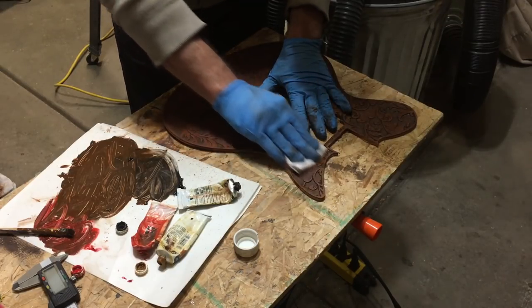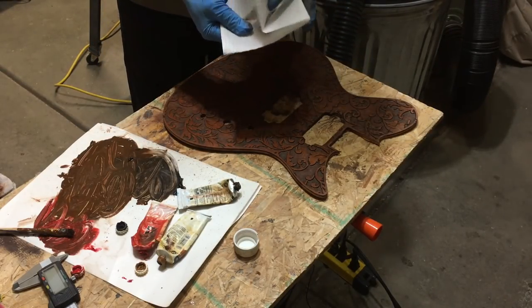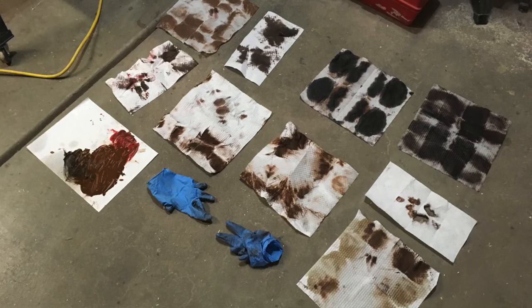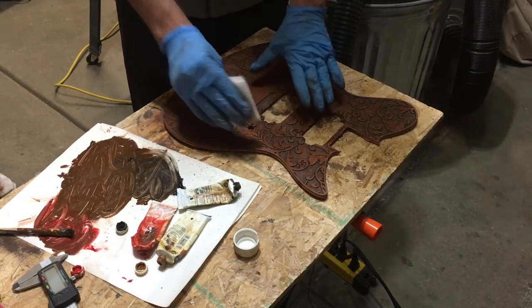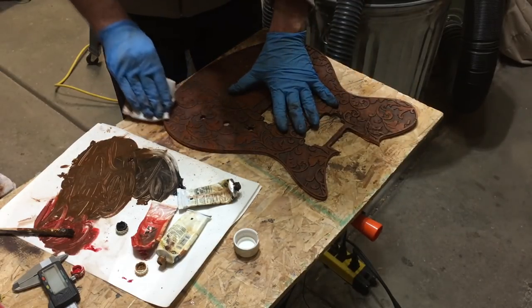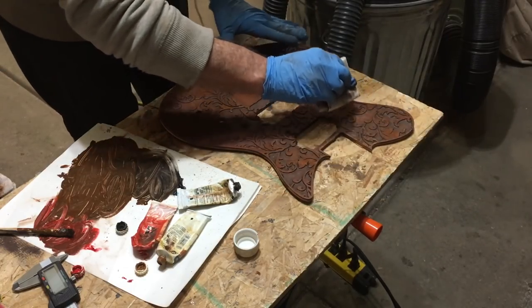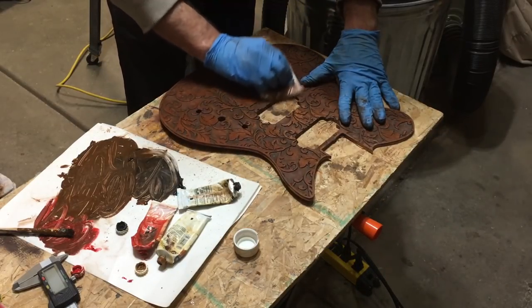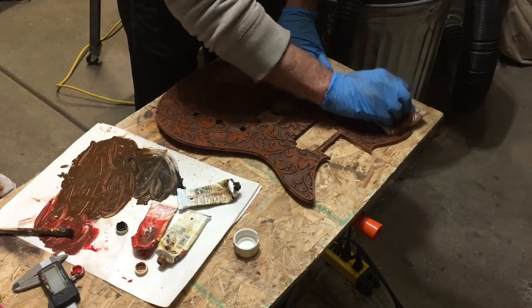One thing I should mention: you're using a solvent and oil-based product here, so these rags are flammable and must be disposed of properly. What I typically do is lay them out flat on a concrete floor so the rags aren't touching each other, and let them dry for several days. If you threw them into a trash can, the heat they generate as the solvents evaporate could cause them to spontaneously combust. Whenever you hear about someone's garage catching fire and the cause isn't immediately clear, it's usually rags in a trash can — don't want your shop burning down over a guitar.